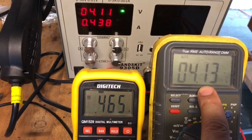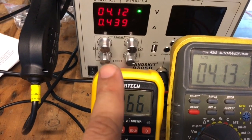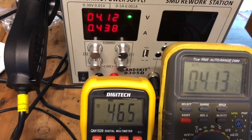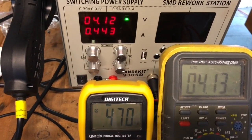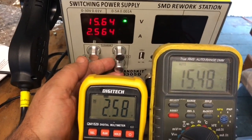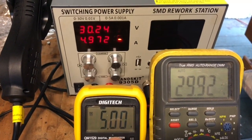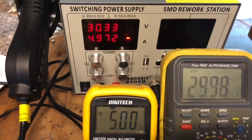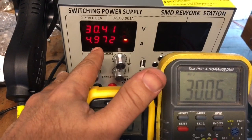I've got a multimeter showing volts and another hooked up in series showing current. The voltage is pretty much perfect. The power supply persistently reads about 27 milliamps too low on the current, which I might see if I can try to adjust. I've tried that out with a couple of meters and it's consistent. I load tested it up to 30 volts and 5 amps — turning the volts up all the way with the amps already at maximum, we get a perfect 5 amps. Giving it a few seconds for resistance to come up — there we go: 30 volts and 5 amps. According to the multimeters it's pretty much perfect, though the screen reads the voltage a little high and the amps a little low.